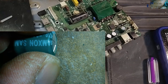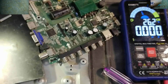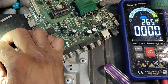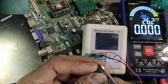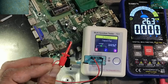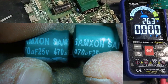This capacitor has also swelling — 241 microfarad. I will replace this capacitor now. Reading 482. I will use this one. Checking its ESR — yes, ESR 0. 470 microfarad, 25 volt — same as the original one.